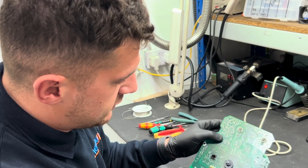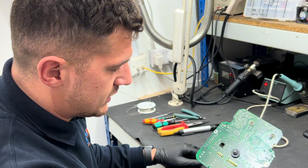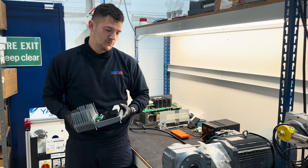We would also go over all the dry joints. Obviously if the solder points are a bit too close, we'll be using some flux, which does prevent the solder from traveling from tab to tab. With that done, this gets the Movimot back together and I am going to be testing it on our test rig, which you can see here.